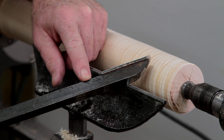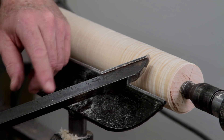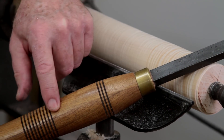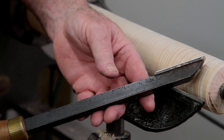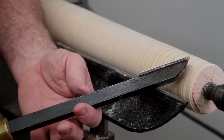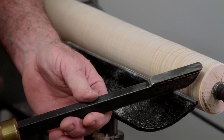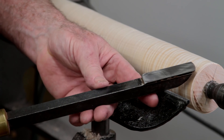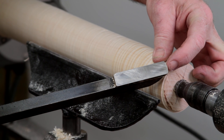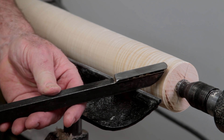This is more of a traditional type Big Ugly Tool. This is on three-quarter inch square stock. My friend Larry Carlin, who does one of the sharpening videos I have, made this for me. He made the sandwich-type handle for this scraper too. Standard stock for the tantung or the stellite is about one-eighth of an inch thick. The problem with these square shaft tools is they are a little bit top heavy. They're fine if you're using them flat on a tool rest like this, but if you roll them up on the edge and you're working on the very bottom corner, that kind of works. If you start getting up near the middle, you can be a little bit off-balanced and get a nice big catch with it.